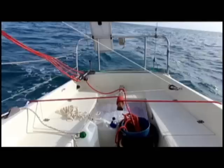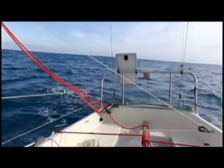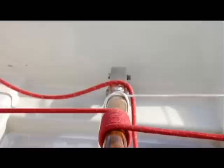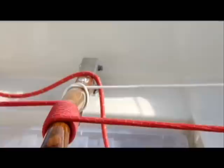This is my take on the Leckett method — I've just been trying it and it seems to work pretty well for when the wind is close to the beam. That white line there goes from the end of the boom to a turning block, straight onto the tiller, and that's balanced by the red bungee. The sheet is attached just with a clove hitch, and that's easy to adjust as well — if it seems too powerful you just slide it down the rudder stock a bit, and for lighter winds slide it back up. It fills that gap between the quartering wind and with the wind ahead of the beam where the bungee usually suffices on its own, certainly on this boat.